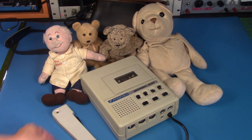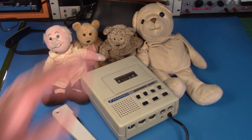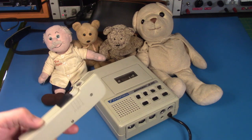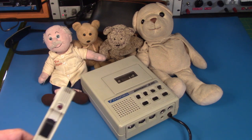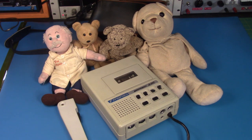So that was music recording on the machine. I had to do only trials and errors because it's so easy to overdrive the recording when I'm trying to do it and it distorts like crazy. The ALC on here does not work very well. So I had to keep adjusting the output level going into the machine, but once you get it set, it's all right. I want to see how it is with direct hookup, see if we can get any better playback of this.